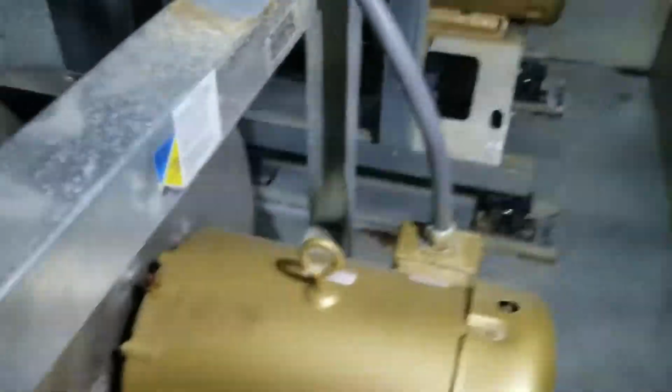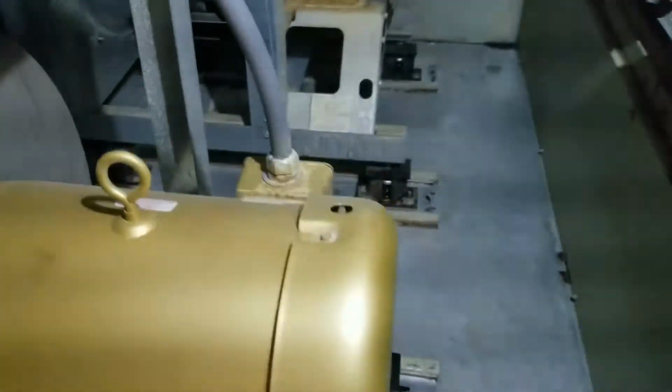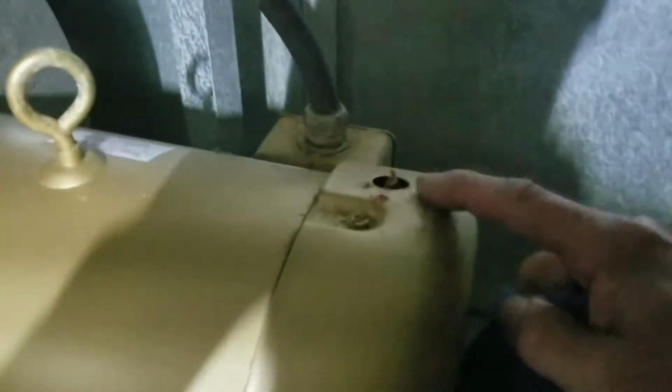So these are my return fan motors. We're going to wipe down the backs of them. I said return fan, I said that wrong. These are exhaust fan motors. And they had a spill up above us, which is some of this crap that you're seeing. But we're going to wipe these down real good, and we're going to get the blower in here and blow all this crap out, blow the motors, and we will get some grease on the motors.